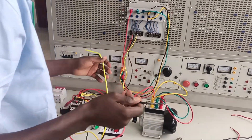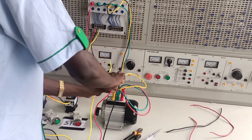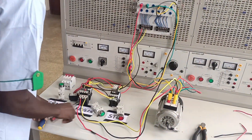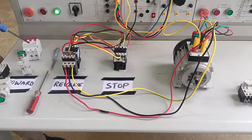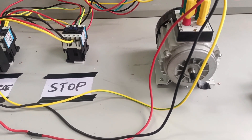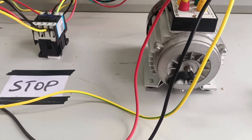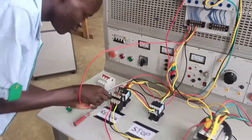The motor's six terminals will be connected in delta configuration — in delta, the connection forms a continuous triangle. For DOL we connect the motor terminals in star, but here we're connecting them in delta. I'm now doing a dry run to test the power circuit: by manually pushing the coil of the first contactor you can see the motor moves in one direction, and pushing the second contactor coil it moves the other direction. We still need to wire the control circuit so it runs automatically.